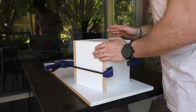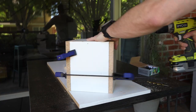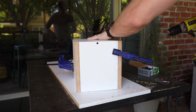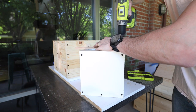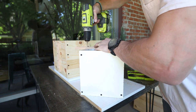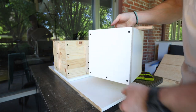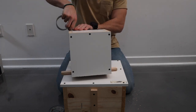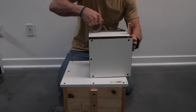I used a small piece of melamine to close one of the ends and then screwed that in. Finally, I attached one more wood strip to the open end of the melamine box — this will help keep the box in place while it sits in the wet concrete. I then used some smooth black tape to cover all the exposed wood areas of the melamine box, which would prevent the concrete from sticking to any of those areas.